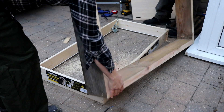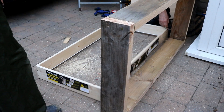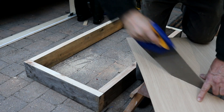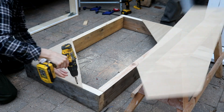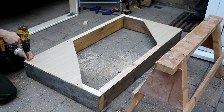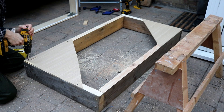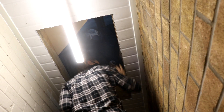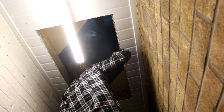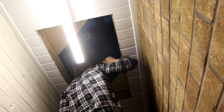Once we'd created the frame, we removed the loft insert from the inside and wanted the frame to stay square. My dad quickly cut some plywood corner gussets, which I temporarily screwed into each opposite corner — these would be removed once we'd screwed the frame to the rest of the roof's framework. The frame with the gussets was then slotted through the hole to test fit. My dad realised he needed to remove a little protruding wood and make the frame even, eyeballing it, knowing the trim would cover the cut fascia later.